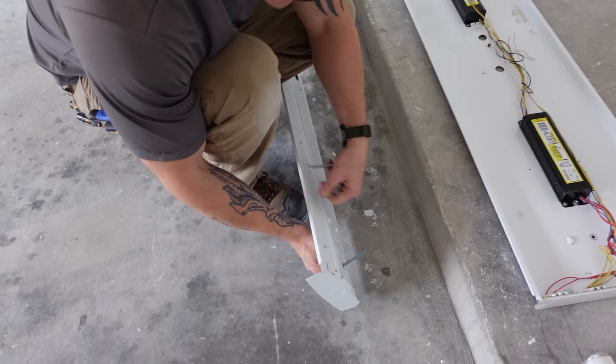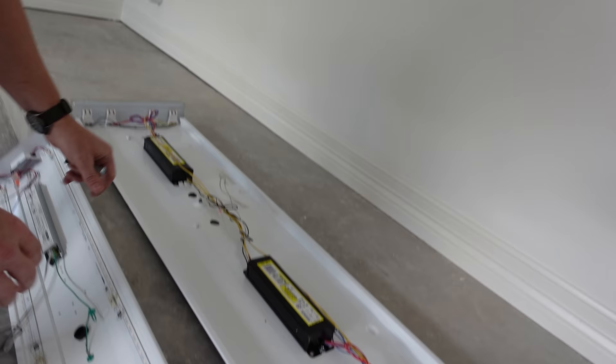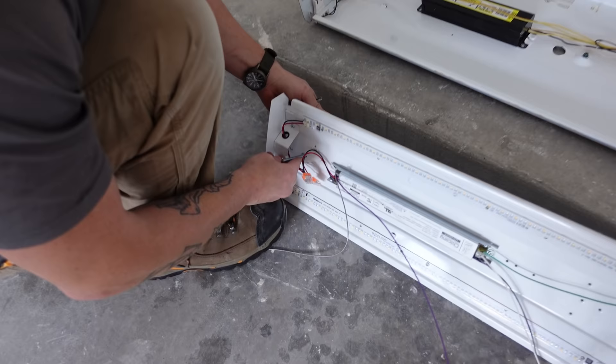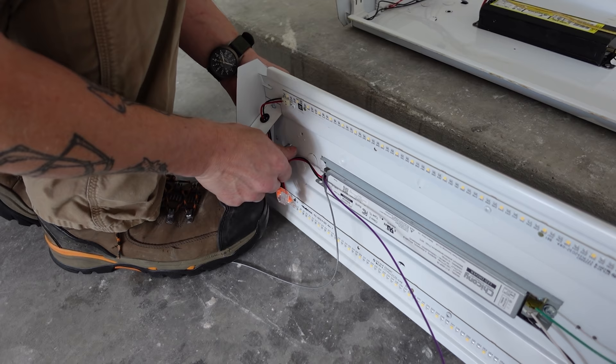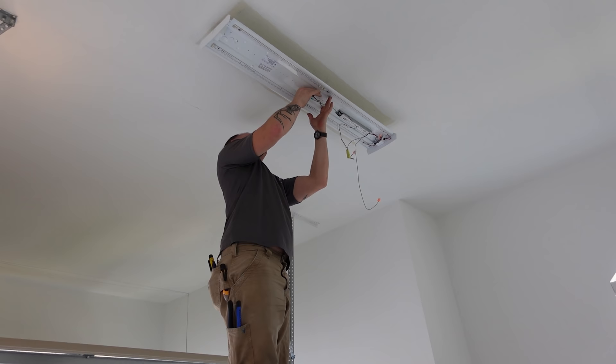The next thing I'm going to do is put brand new toggle bolts in these new fixtures. I always prep the toggle bolts first — take them apart, stick the bolt in, put the toggle end just barely on top, screw it in enough so when I stick it through the sheetrock it won't fall off, but not all the way down. Then I stick the fixture up there and pop each toggle bolt head in and let the fixture hang. If for some reason I have to take it back down, you're going to burn one of those toggle bolt ends because once it's up in the sheetrock, there's no way to get it back out.